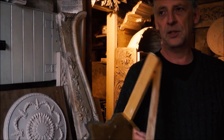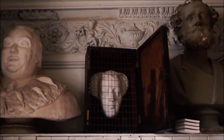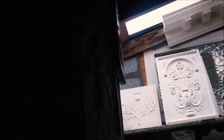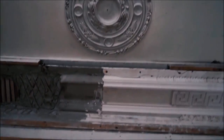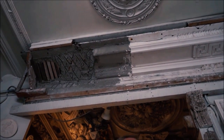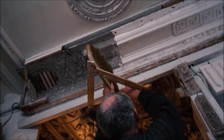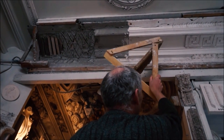Once you've got your running mould, there are two ways you can make a cornice: you can either run it on a bench and then go and screw it up, or you can make it in situ — in position. There's not a right or wrong way. Traditionally in this area, it was more normal to make it in situ; probably in England it was slightly more common to make it on a bench, but it came down to local preference. Going back to the days of horses and carts and dirt tracks, the chances of transporting lengths of cornice very far and having them arrive in one piece was a bit remote. You can see above your head the different stages of running a cornice. The first thing was to put up thin strips of timber known as scotch brackets, which gave you something to build the cornice onto. Then you nail up the cornice rod, which the running mould runs on, and as you build up your layers of plaster, you gradually produce the finished profile.